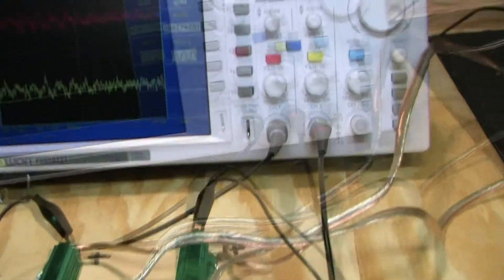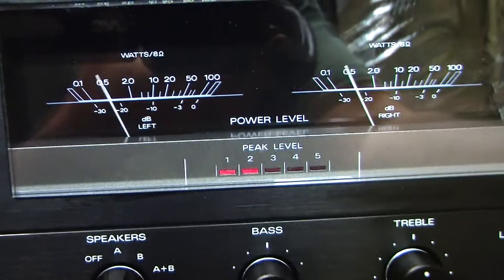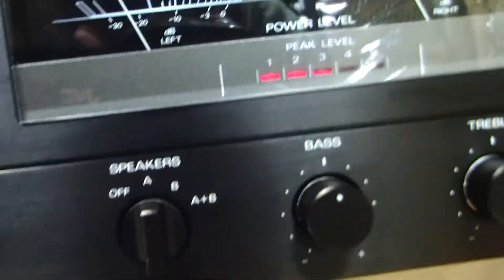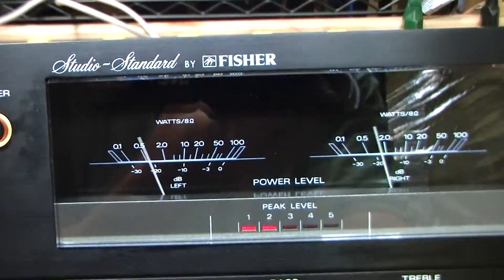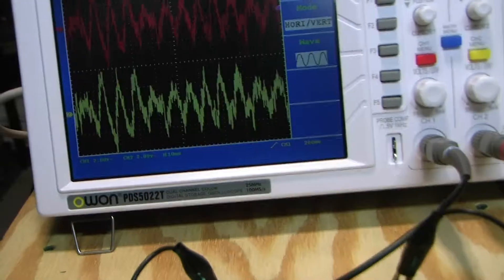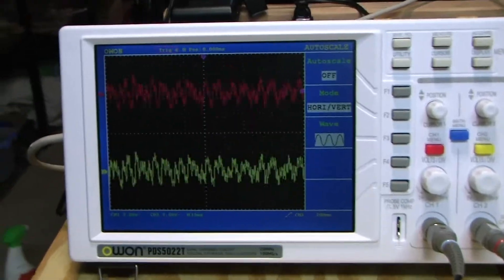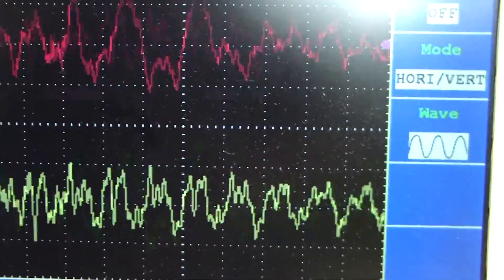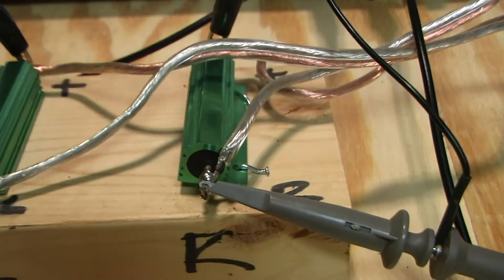Back — I couldn't seem to get a signal through my Sonos, but now we have it. So we turn it up a little bit, and you can see both VUs are indicating power on both channels. I'm on stereo and this music has a lot of differentiation between the channels. I'm going to push mono right now just so both channels are the same. Both channels are showing on the O-scope, which is set for two volts per division, with one channel hooked to the left dummy load and the other to the right dummy load.